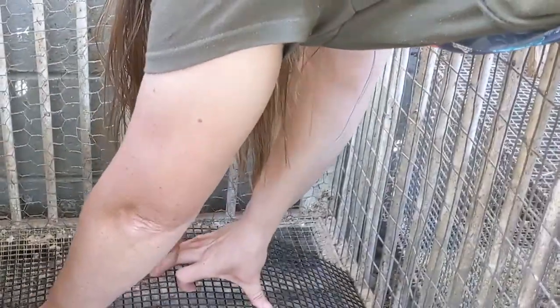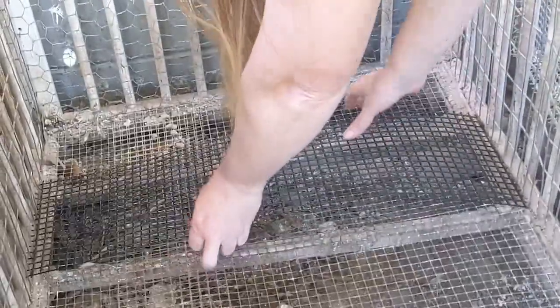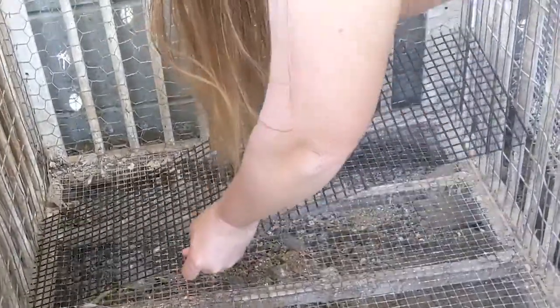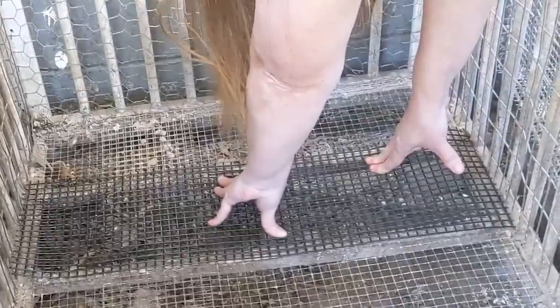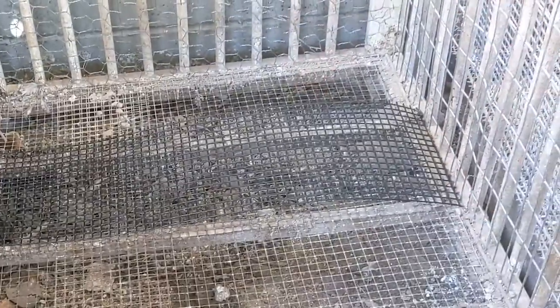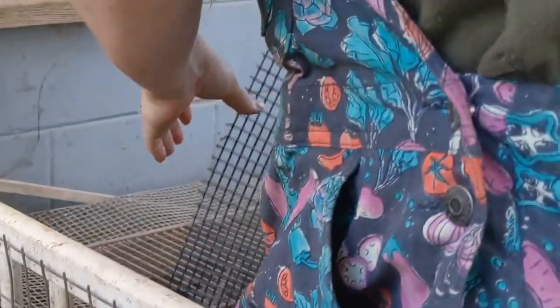I'm placing this right over this section that's bad and I'm going to screw it down, tighten it to the base, shift it a little bit so that it goes all the way in. I hope I didn't do it too long — that should work well once I put the screws in. It covers this corner where the repair needed to be done. It's much bigger than we needed, but if part of the floor is already caving in, then other parts of it are probably soon to do so as well, so might as well cover it as much as we can.